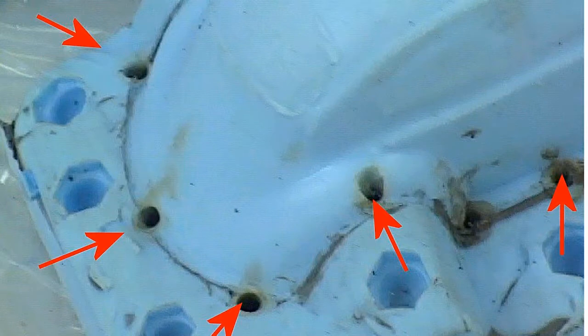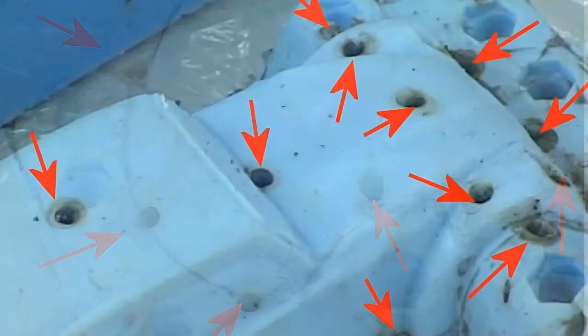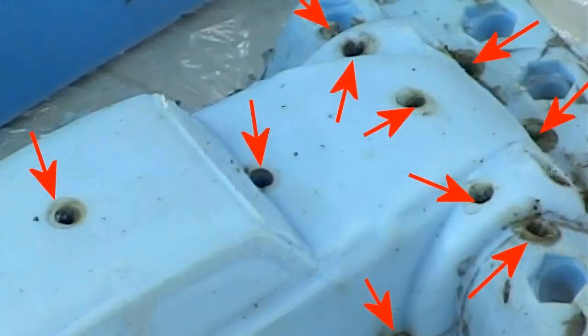Examining the top side of the inner rubber mold, you can see that the mold maker bored holes all along the top edge of the mold. That's because air tends to flow to the top in liquids and it needs a place to escape, or it will create air gaps in the cast material when it's cured. The vent holes are spaced about 1 inch apart. Not only are the vent holes added all the way around the perimeter, but they're also added to the top surfaces of the inner mold where air will tend to accumulate. The holes will allow the air to escape.